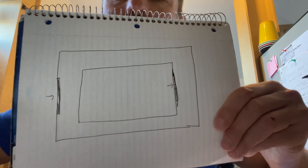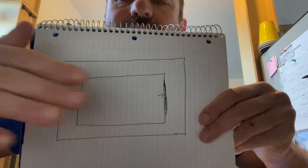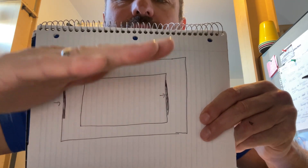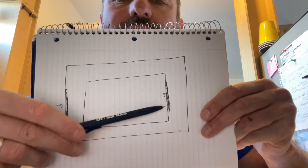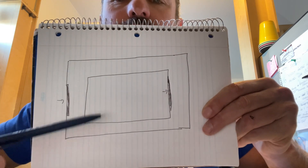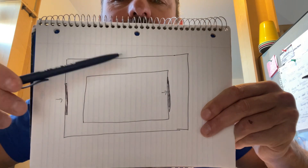Is it possible that something's wrong with the machine? Not that it's fundamentally broken, just that we need to tweak the setup. So let me give you an example of some indicators that the rotation compensation is not set up right. If you have a sand-through happening on one side and the other side, there's a good chance the sander is tilted that way. You will notice along one edge it's not sanding, but it's sanding through on the other side. I would go for the rotation compensation and just tip it back a little bit until you get an even sand.